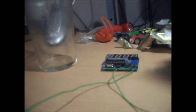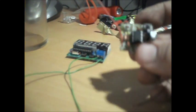Buzzer, no. Switches, top, bottom, contacts. So they sort of kind of do, but I actually found they'll only go in the holes one way anyway. Crystal for the clock, no. The ceramic caps and resistors, nope. There's no diodes on that one. There was a couple of Zeners on this one. I only know there's Zeners because I watched Julian build this. I did get one of the resistors round the opposite way to the other three, but it doesn't matter. Resistors don't matter. It just looks weird, you know. I've got three all facing the same way and then one hidden between these caps and the IC there. That's facing the other direction. But like I said, that don't matter.